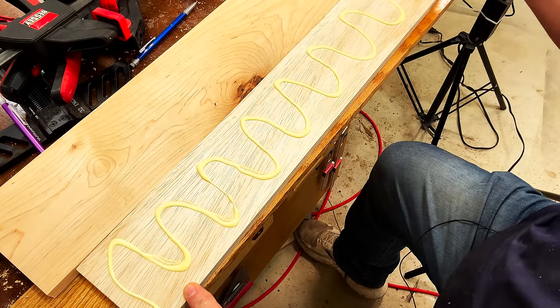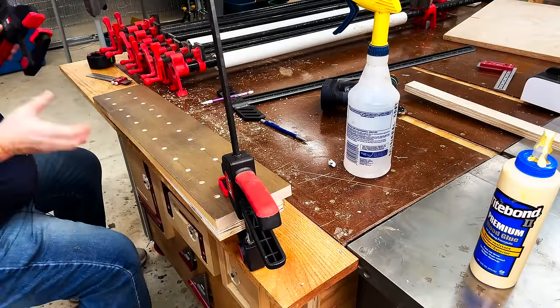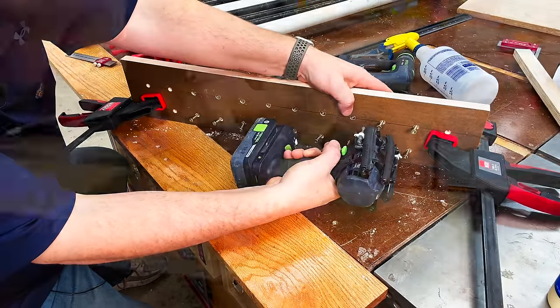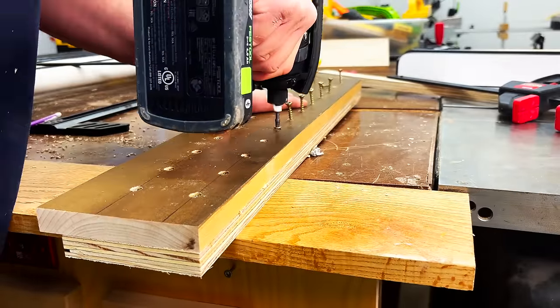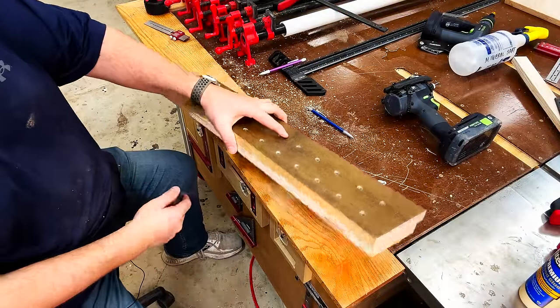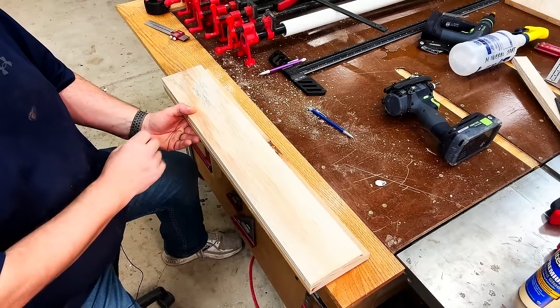I'll add a little bit of wood glue and laminate the two pieces together, throw some clamps on them, and drive screws in at every single one of those pre-drilled marks. Now that I'm completely confident these two pieces of wood won't separate, this is the time when I would add a French cleat if I was adding it to my French cleat system. But since my pipe clamps are so long, I'm actually going to mount this directly to my wall.